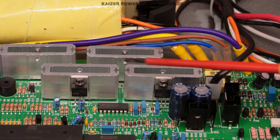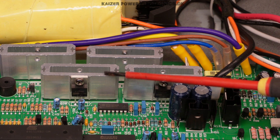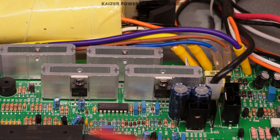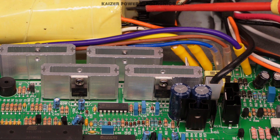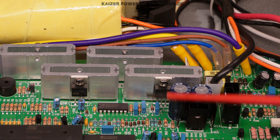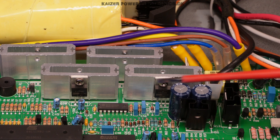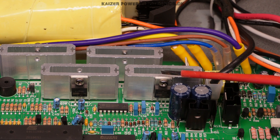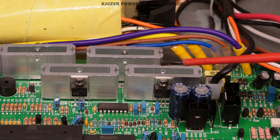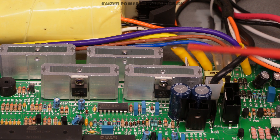The full bridge power sections just sit with 4 passive heatsinks. As we can see these are TO220 packages, and with only passive cooling there are no fans inside. We have a large transformer sitting right next to it, which is rated for 130°C. I would say that this design is likely to kill itself from overheat over time if it is not installed in a proper forced-air cooling 19-inch rack. A small unit like this would most likely be bought for small businesses or home use,